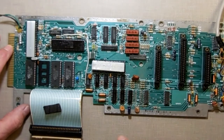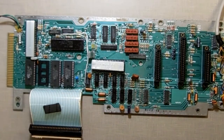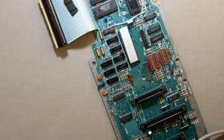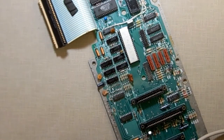I figured that's going to take forever, so I realized I can just take my Dremel and cut the chips off, then leave the little legs here. Then I can come back in and pull the legs out with a soldering gun. I'm just going to remove one chip on camera here so you can see how it works. I'm wearing my mask because this thing puts out a lot of dust.